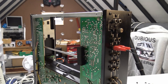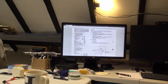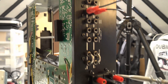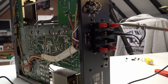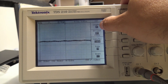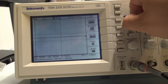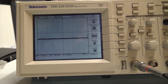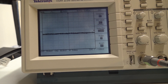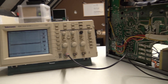Looking at the service manual, it's suggesting we should check the center voltage of the drive transistors. You short out the inputs, put a meter across the speaker connectors, and switch the scope to DC coupled mode to get a DC reading. Right now we're in AC coupled mode — hitting the button, going to ground, and there we can see we're pretty much bang on zero volts. Our center voltage should be better than 30 millivolts and we're actually less than 10 millivolts. This thing is looking absolutely spot on — we'll give it a clean bill of health.